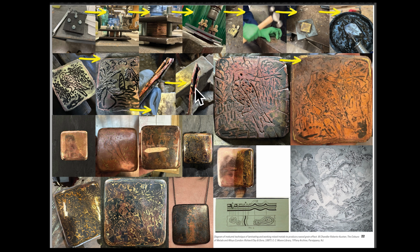But as these two demonstrate, I had the harrowing experience of the billet splitting, which meant that I could no longer use it, I could no longer pattern it. And so luckily I was making two billets at the same time, but this is a direct result of brass spillage. When it spills out, the layers don't fuse and you get delamination. I moved on because I was making two at the same time, because my failure rate is about 50-60%.